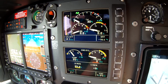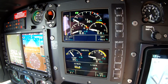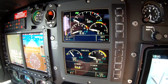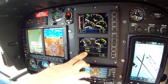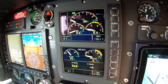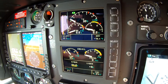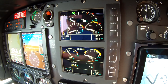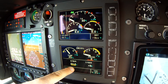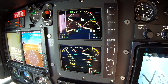The biggest thing that we are looking for is to watch the heat on the power turbine, the turbine outlet temperature. If the FADEC notices that it's getting too hot, it will shut it down. The only thing that is not foolproof on the FADEC, that the computer cannot sense, is our volts. If we have a weak battery and the volts get down to 17 volts, the fuel valve will release and the FADEC won't know what's going on, and that's when a lot of interesting things can happen, and you can get into what us pilots know as a hot start. So we do want to double check. We know how computers can be glitchy. Our first attention will come up here, but our biggest thing to watch is the volts. This is a 28 volt system. As long as we don't get down to that magical number, everything will be just fine.